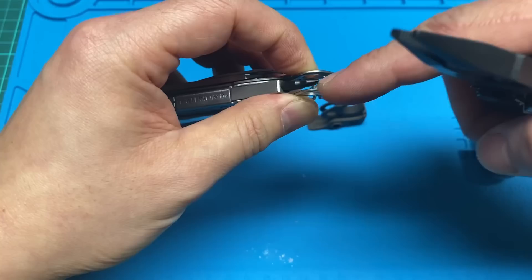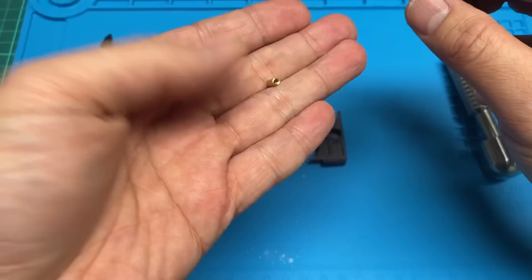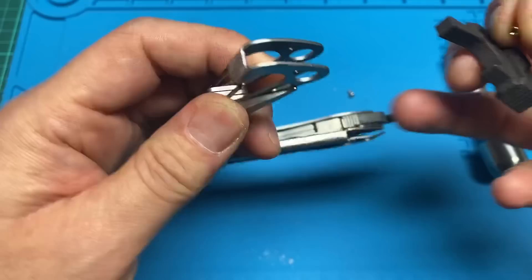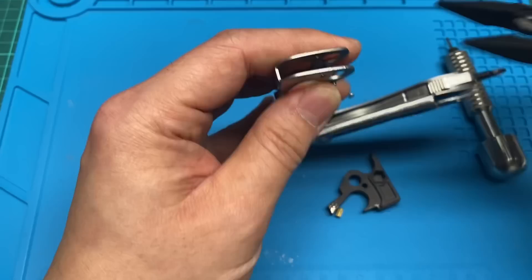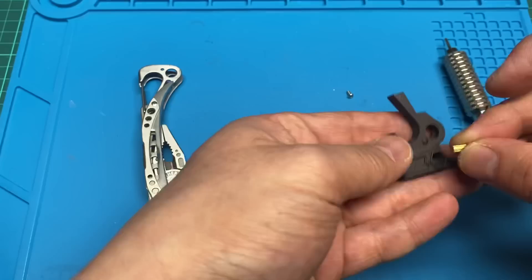The key to installing this hammer bit is using these tiny metric M2 threaded inserts and metric screws. They look really tiny but it's nice and snug when it's in there. This hole corresponds to that hole, so I've squeezed them in a little bit — it's still slightly splayed out — so I'm going to take this and squeeze it just a bit to close it up. Any pair of pliers will do just fine.